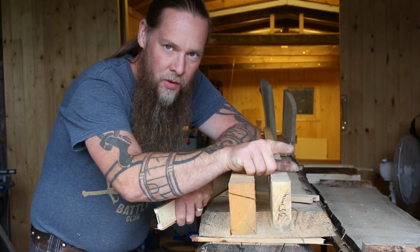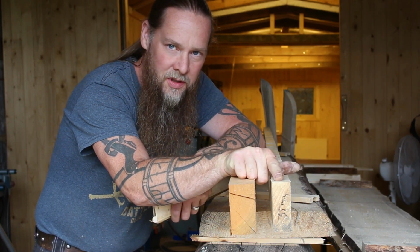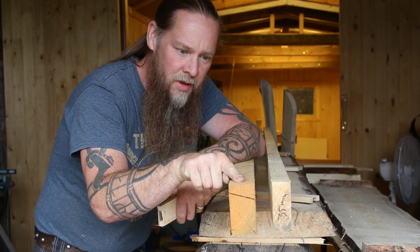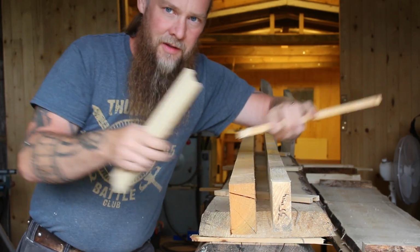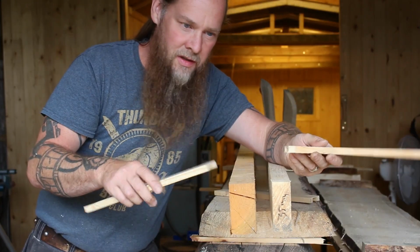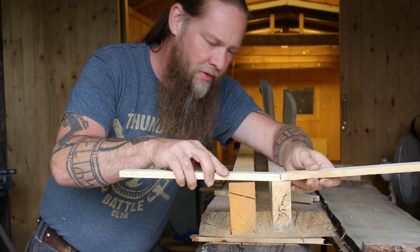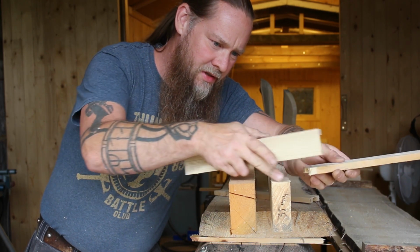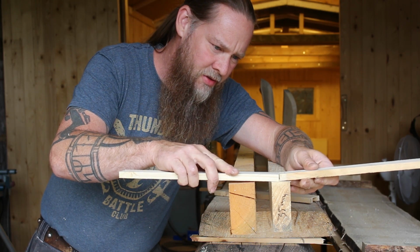I decided to swap this beam that I was planning on using as the central support for this one that I had in my wood pile. And that's because the slats that will support the mattress, represented by these cut-offs, they will meet on top of that beam. And I'm not sure if this 35mm wide beam is giving them enough support.